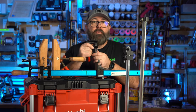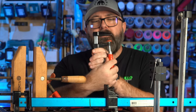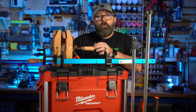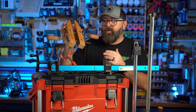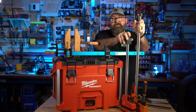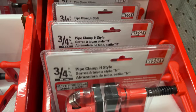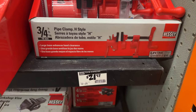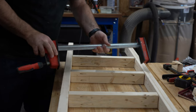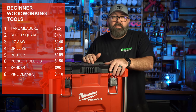These small clutch-style bar clamps — also known as F clamps — are great for holding down small pieces and I use them frequently to hold down a straight edge for quick cutting. There are also strap clamps, face frame clamps, track saw clamps, and old wood hand screw clamps that my dad gave me — I used them way more than I thought I would. Parallel clamps are by far my favorite and are great for assembling panel glue-ups and cutting boards, but they're not the best option if you're just getting started. I recommend pipe clamps because you can buy more of them and they work great for a wide variety of projects due to their unrestricted length. Add four clamps at about $20 each — that's about $80 — plus about a $30 piece of pipe.